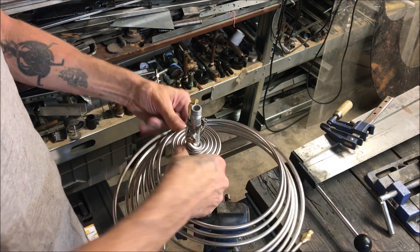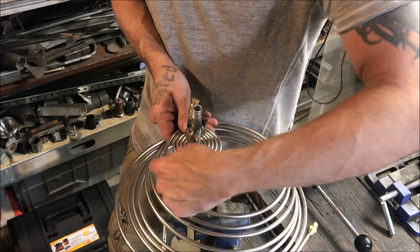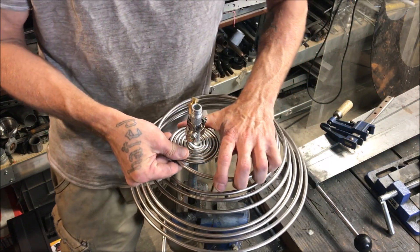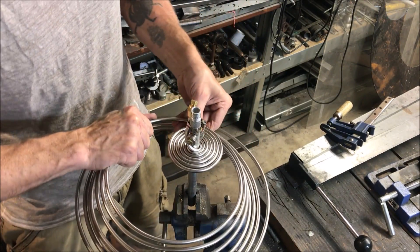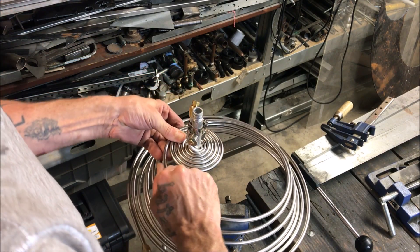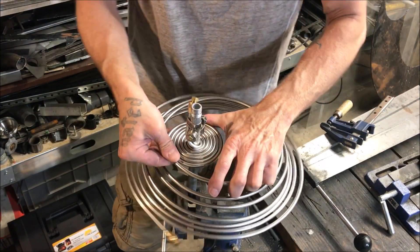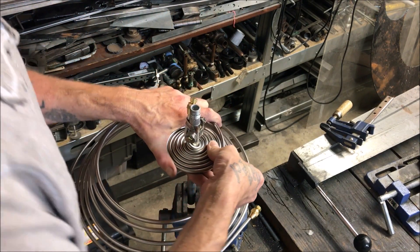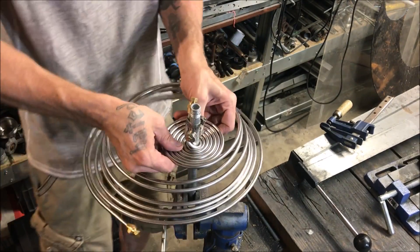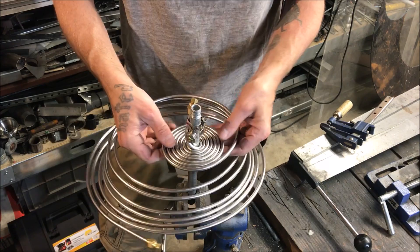The challenge today is to spin this coil out of some stainless steel tubing. I regret not using all 3/8 tubing because that would have given us a little more leeway on buildup. We're going to have to clean these coils out periodically because of lime, unless we use some type of reverse osmosis filtering system and water softener. Using rainwater may be an option — does anybody have any information on that? I know rainwater has acid in it, so we wouldn't want that. This is getting harder and harder to spin flat.